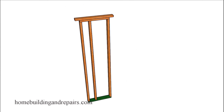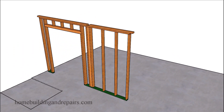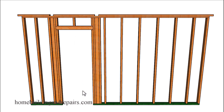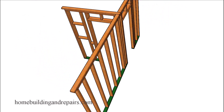We're putting together and taking apart certain sections of the house to get a better view of individual walls. Even if you're disoriented right now, I'll go ahead and throw the foundation in — we have a closet here, bedroom over here, the porch and entry to the house at the front. Next up let's install the door separating the bathroom from the bedroom. This entry door into the bedroom has a channel on one side and a channel on the other side — and don't forget you might need some towel bar backing in this wall.